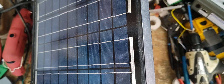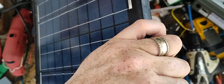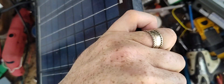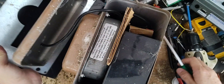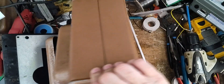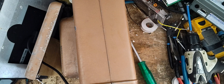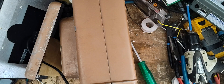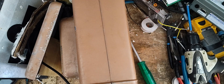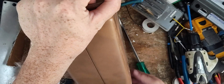So the story on this: it didn't turn on. The note says 'won't power up,' and I did try to turn it on - it didn't come on at all. The customer sent the entire unit along with the battery. We're going to check the battery first because that would be the easy fix. I hate these things with big heavy batteries - so many people think it's heavy duty, but it's heavy because it's got a 10 pound battery pack. It's basically two 6 volts sandwiched together in series to make 12 volts.